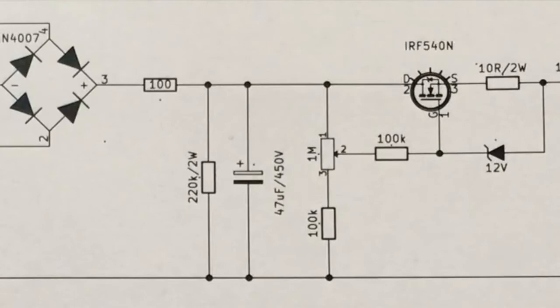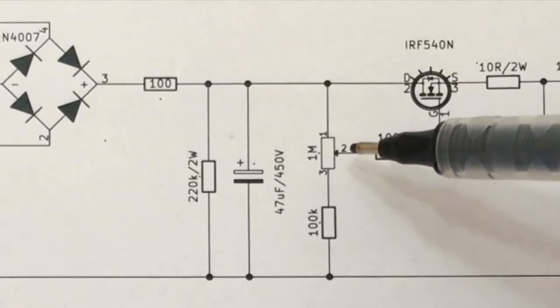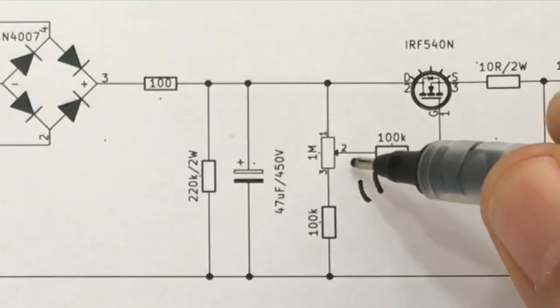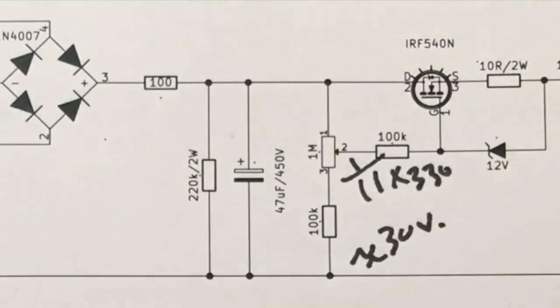The other change is I've put in a 100k resistor, which is used with most of the guitar amplifier applications of this variable voltage regulator. The reason is that we don't need to worry about the low voltages. When the wiper of the variable resistor — the pot — is at zero, we end up with basically one-eleventh of the voltage times 330, so we get about 30 volts minimum. I can change that, make it higher or lower. I'm thinking of perhaps putting another resistor in here and having a switching system to drop some voltage off the top or bottom, but I can think about that in the future.